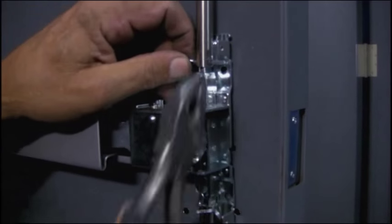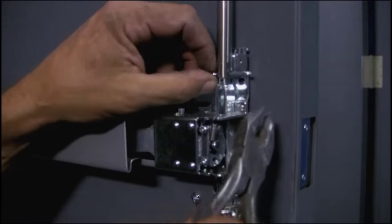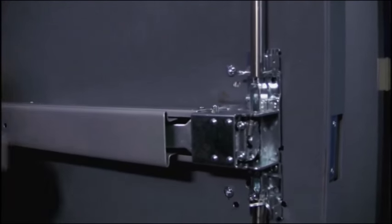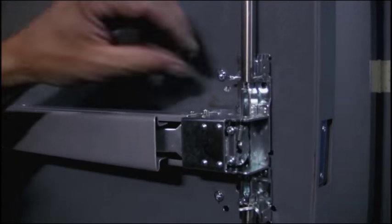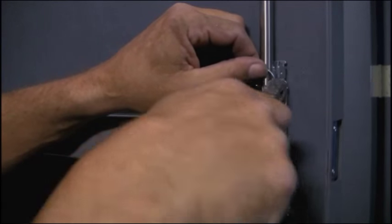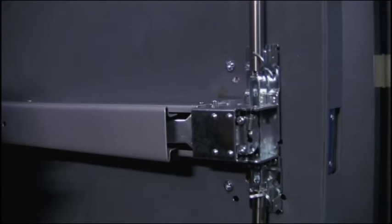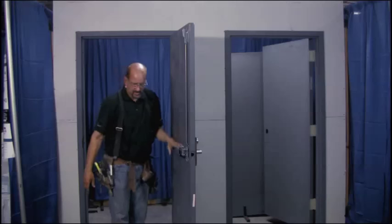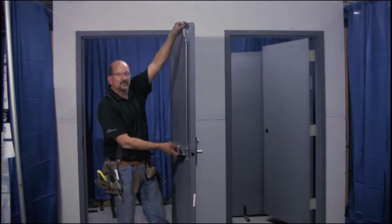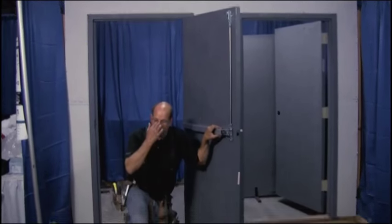Take your cotter pin and slide it right in there. When I'm just starting out setting this, I don't bend the cotter pins up all the way — just spread them a little bit to make sure they don't fall out on you. Now you've got the top rod attached and the top strike attached. Go ahead and test it, make sure it'll flip over. Looks like it functions pretty good. I hold my hand up here instead of a strike so I can keep testing it. Every time I add a piece of hardware, I'll test it and make sure it still works.